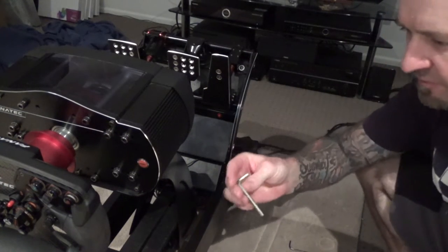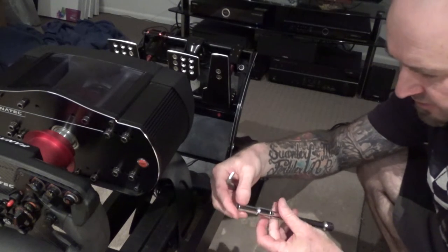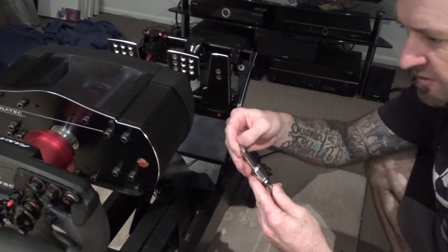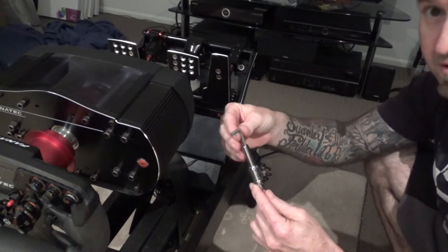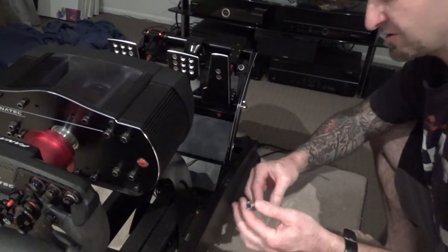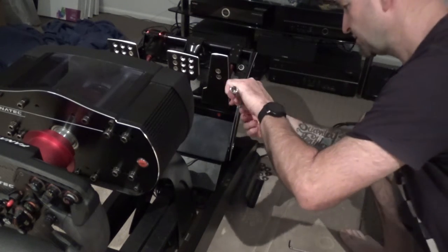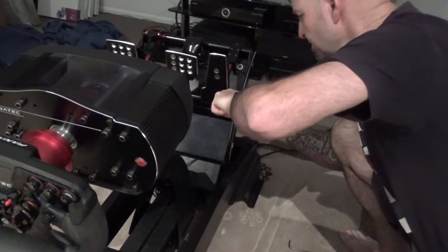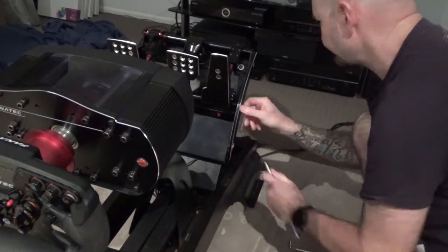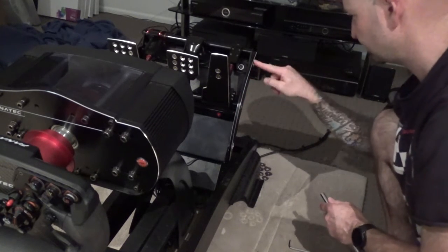I've gone and found a wrench that is a better fit for more leverage. I've got an 8mm deep socket on an extension bar so that fits over the wrench. Any piece of tube that's heavy enough would be ideal - as small a diameter as you can, just enough to fit over it. That was actually quite tight, so it's a good idea to leave your pedals mounted to your rig until you loosen these off.